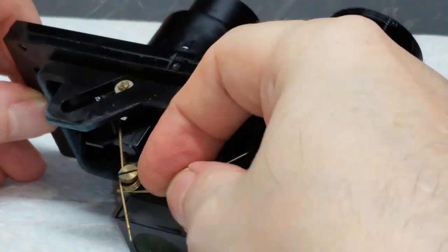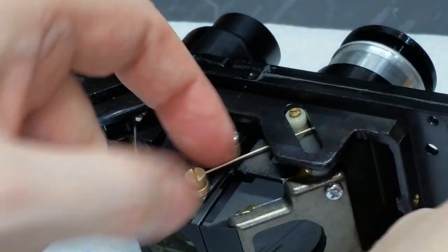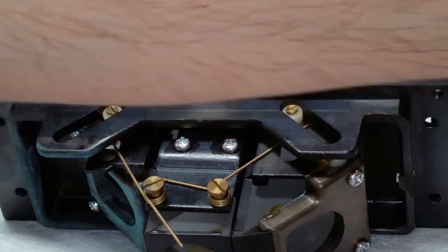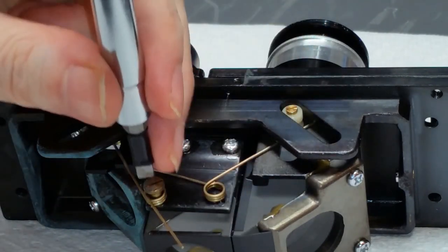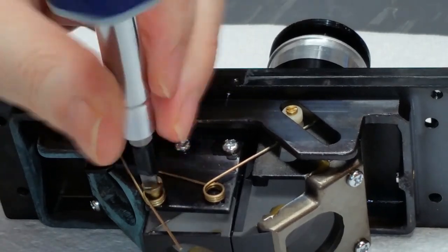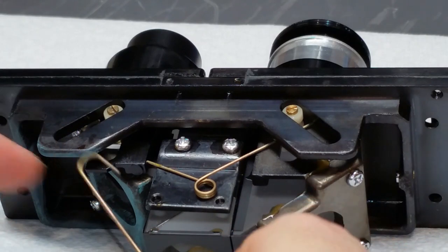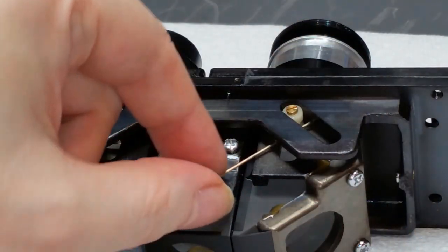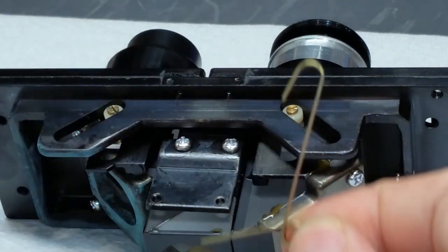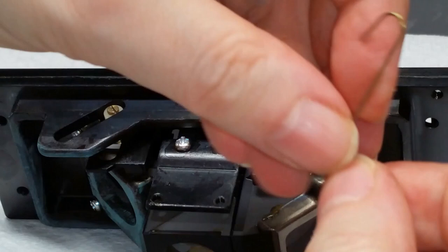This spring here is a little different — it goes the other way. I move it this way, get it on the other side, lift it up over the screw on this side, and now there's no tension on either one. Now I take a flat-bladed screwdriver in these slotted screws and carefully loosen and remove those. The screws come out and then I can take the springs out as well. The springs just have a hook that hooks over these white nylon follower keys — to take it out, just reach in and unhook it. One of them has kind of an L-shape and the other is straight — the L-shape is typically on the right-hand side.